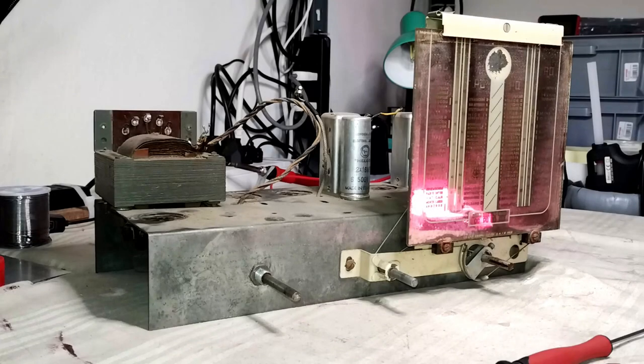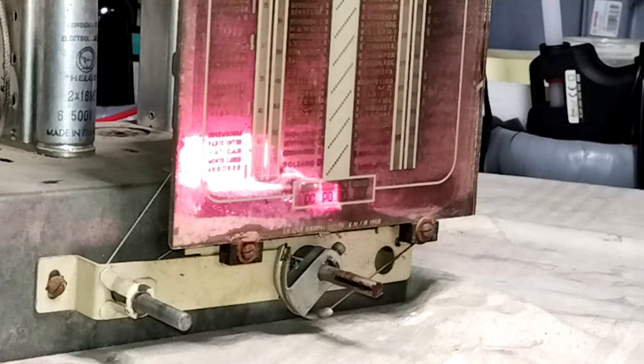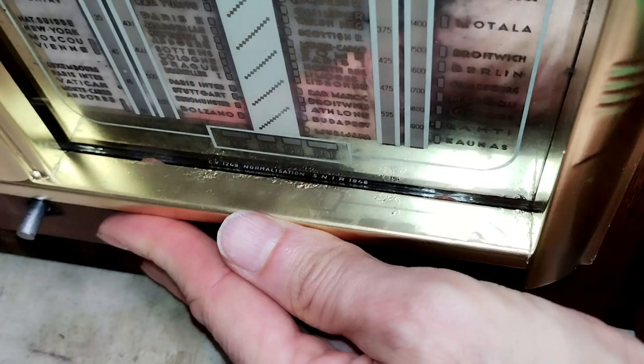The dial glass is held on the dial panel only from above. At its base, the glass is just sitting on two rectangular grommets. At the bottom, it is not possible to put anything to hold the glass on its panel, because it would stick out of the decorative metal frame, while inserting the chassis back in the radio cabinet.